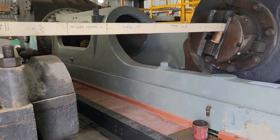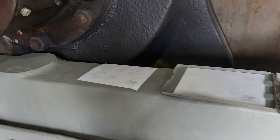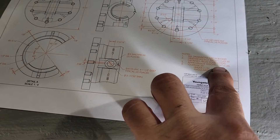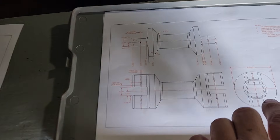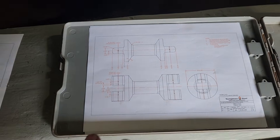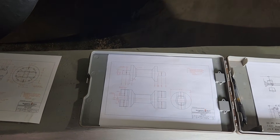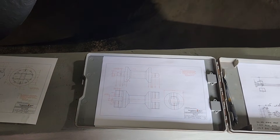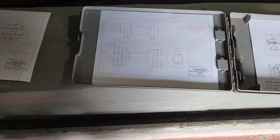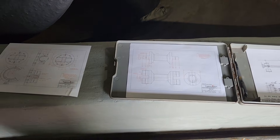So this is basically what we have to do. These aren't small pieces — this casting here is going to be 1,947 pounds, and this one here is about 2,800 pounds. The Todd drawing gave a spec of 0.35 to 0.45 carbon, which is basically an AISI 1040 steel — a pretty common grade, nothing special, just a little higher carbon steel. And for what we're going to be doing with it, that'll be more than plenty.